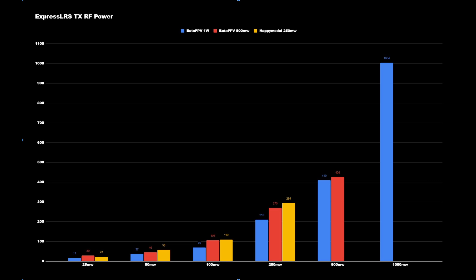Looking at the chart: I've been testing the BetaFPV 1 Watt, the BetaFPV 500 mW, and the Happy Model 250. One important note — different power setting levels across modules should not be taken as one module being better than another. The output levels below maximum are set within the Express LRS firmware by the developers and are not calibrated, so variance between modules at various settings isn't a reflection of quality. Looking at the big number first: at the 1 watt setting I was getting an average of 1004 mW, so I am comfortable that this module is producing 1 watt of output, and that output does not vary greatly with temperature.